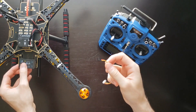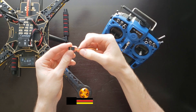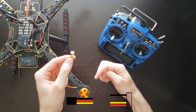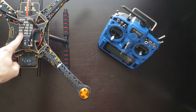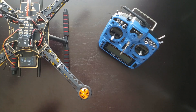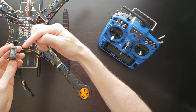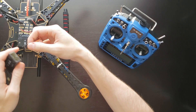Next, go into your wiring kit that came with the Pixhawk 4 and find this cable. On one end you've got yellow, red, and black — this is going to go into your receiver if you're using SBUS. On the other end there's a five-pin connection: black, yellow, and red, and this goes to the Pixhawk. On the Pixhawk 4 flight controller, we've got the DSM/SBUS RC port — plug that in there if you're using SBUS. There's also a PPM RC port if you're using PPM. On the X8R receiver, the SBUS port is on the bottom right-hand corner; from outside in, it's ground, high voltage, and signal wire, corresponding to black, red, and yellow.